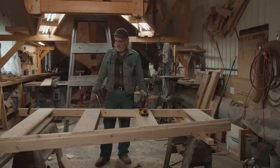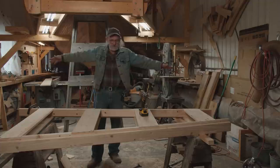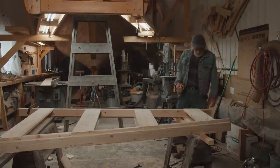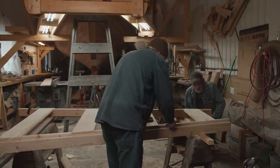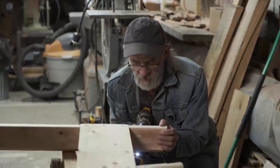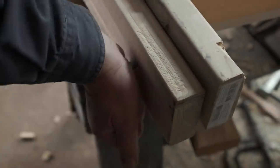We've got all the assembly of the wooden parts done. All we have to do is drill a hole in the top for a bolt on each end so we can fold it out like this, and run a piece of line through — probably right here — just to stop it from spreading. The line's adjustable so you can have any spread you want. It's a staging horse, not a boat. I've got a mark three and a half inches from the end, going through both two-bys at the same offset.